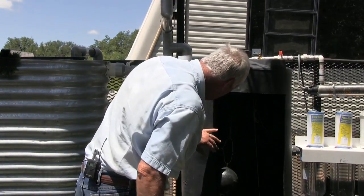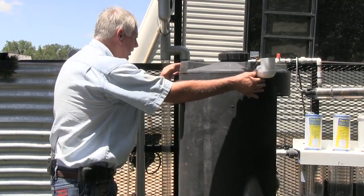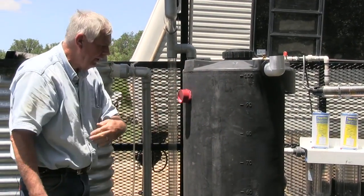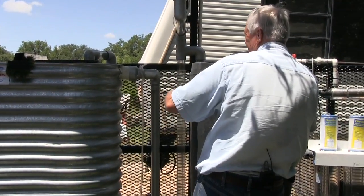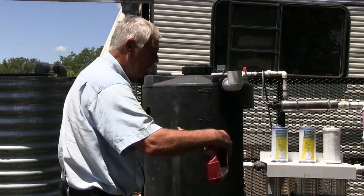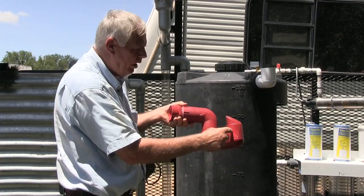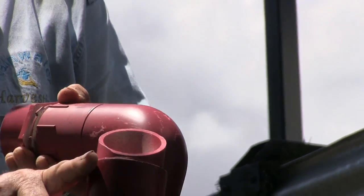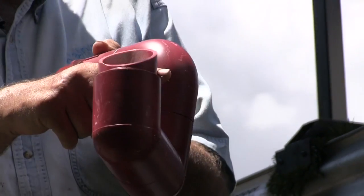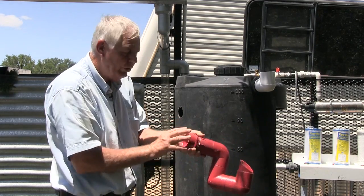The other thing inside is the overflow. I have an overflow tied in on the inside so it acts as what's called a skimming overflow. On this one I have a small p-trap with a little bit of water so critters cannot go into it. It's also cut at an angle so it takes water from the top and sends it into the overflow below.